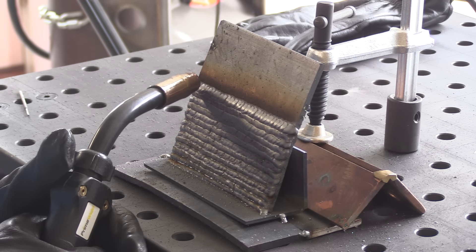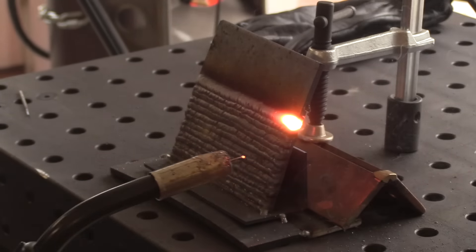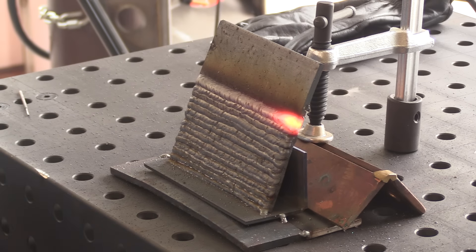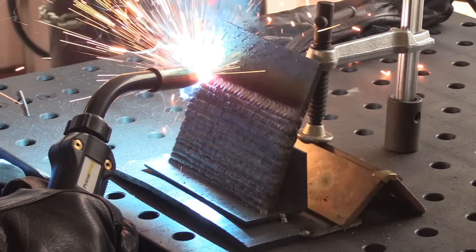What you have to recognize is that when you get to thicker metal — like 3/8 of an inch, half inch and thicker — you're going to need an industrial machine with 250, 300 or more amps. But the techniques that you perfect and learn here using a small MIG welder will carry over. You just need to educate yourself on the difference between short circuit MIG, spray transfer, and pulse spray. If you're a beginner thinking about a 115 volt MIG or you already have one, just get yourself some 11 gauge.